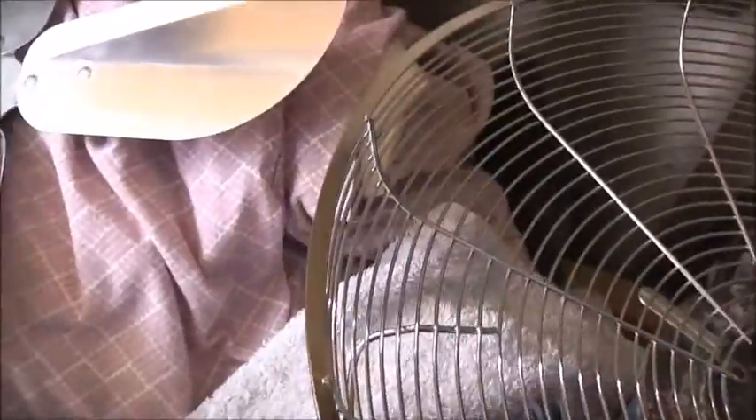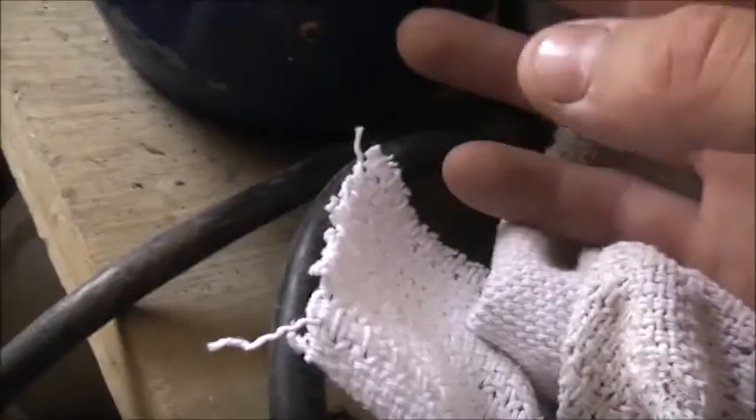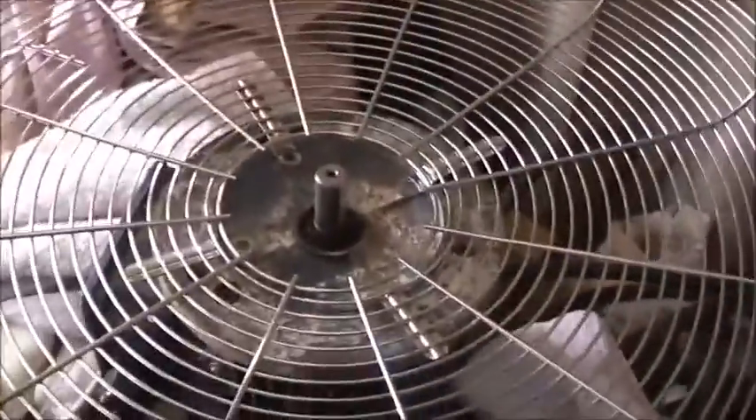This would be a good fan now, running off a variable frequency drive. You get the benefit of forward and reverse too, any speed — this will kick ass. I can make a bracket that bolts on here, goes down, with a bolt in the middle and an off-stem to sit on that stand. Perfect. That's a better motor — a much better motor than any crap. Worked out quite well. Solid as a rock. It ain't going anywhere.